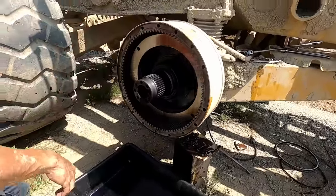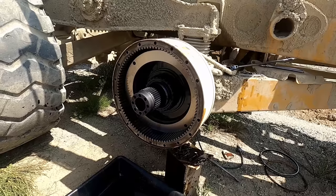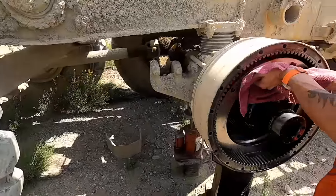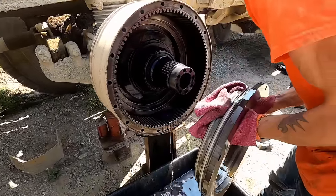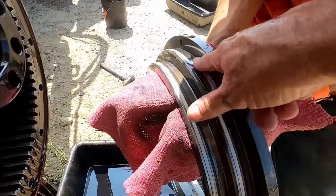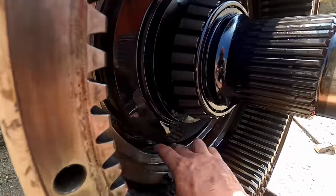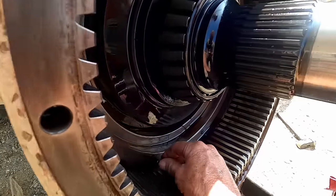We got all four keepers out. We just had to get a bar in there and jiggle the piston a little bit to get it out. We'll lift it out and see what the seals look like. If there's no damage to the piston and the hub, we'll just put new seals on it, reinstall it, and go back together. Oh yeah — look at that, it blew the seal out right there. We'll get that changed. I'll look in here and I'm sure it's going to be good. Yeah, it looks fine — surfaces are real smooth. We'll get new seals on here and put this thing back together.